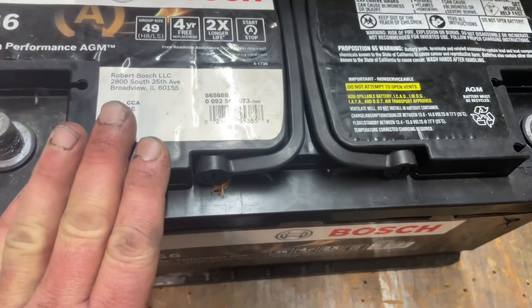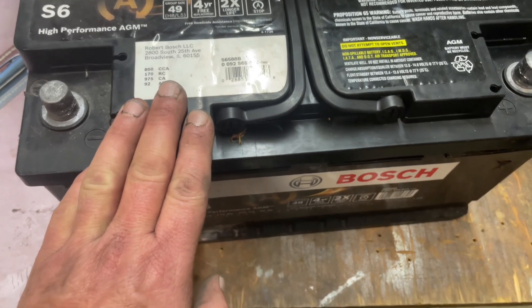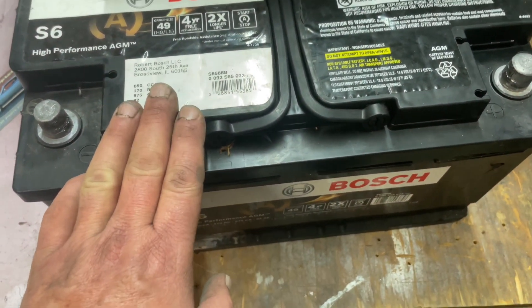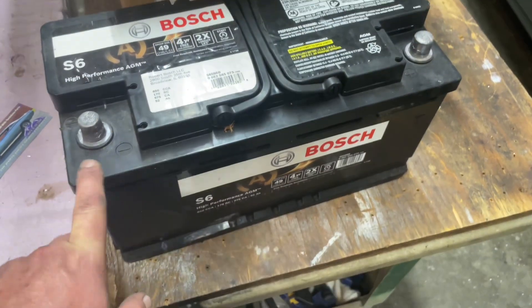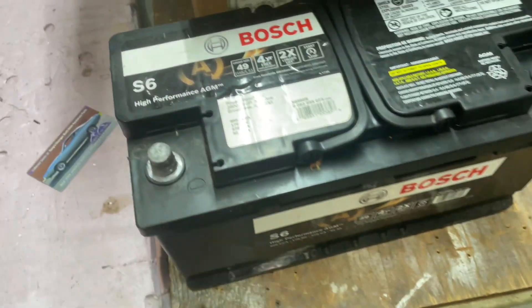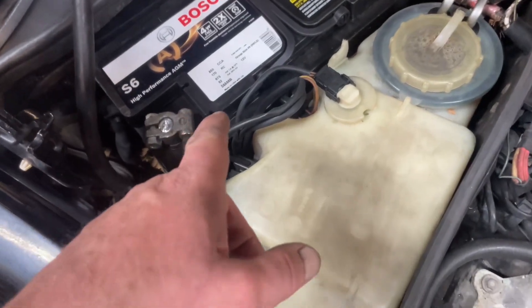I got a new replacement S6 battery ready because winter is coming up. This one after three years is only holding about 60% of charge when fully charged and drops off rapidly. They say 14 to 14.5 volts charging — the Bosch regulators are all 14 volts. The one I put in cost 50 bucks, but the batteries are by far more expensive so I went this route.